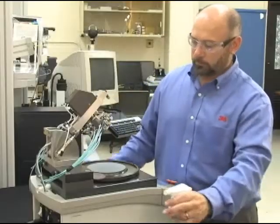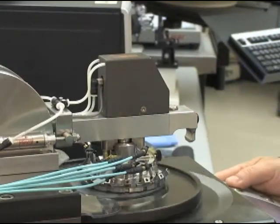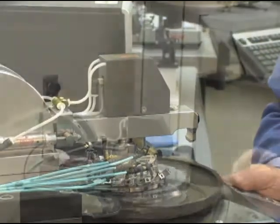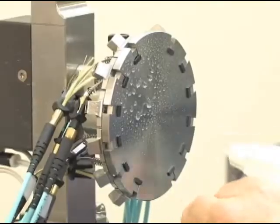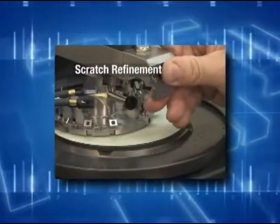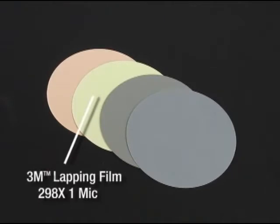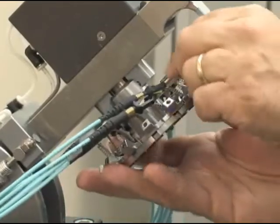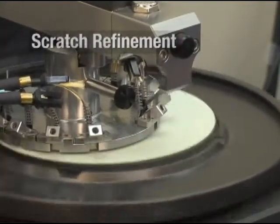In general, a 60-second cycle under low to moderate pressures with a controlled water amount will produce good results. Next, we move on to refining the scratches and building more protrusion with flocked-type abrasives. 3M brand polishing film 298X 1 micron aluminum oxide provides the finish to move on to the final polish. A 90 to 120-second cycle at higher speeds and higher pressures should produce good results.